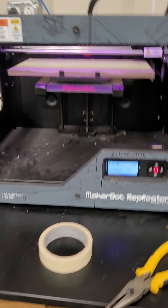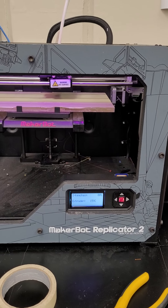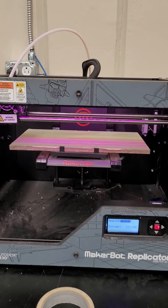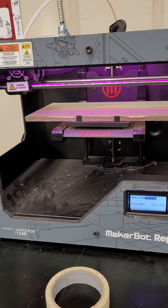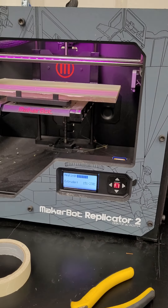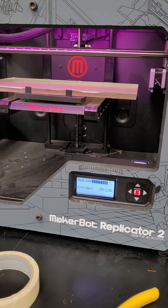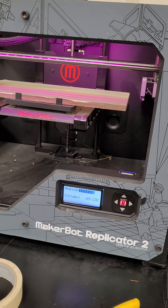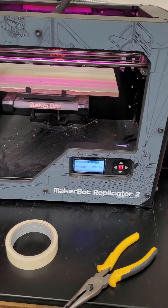Watch it do its thing — it's heating up the extruder. Once you get to the point where you want to change filament mid-print, poke around in the M menu to pause the print, unload the filament, reload a different color, then find Resume. And remember — on the Replicator 2 it only uses PLA and only uses the SD card.